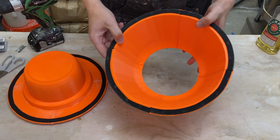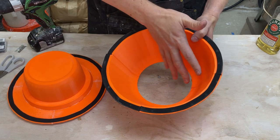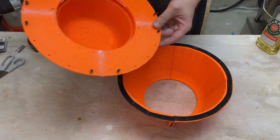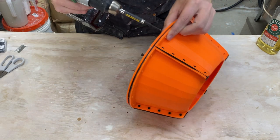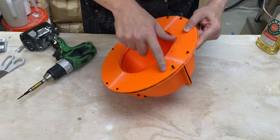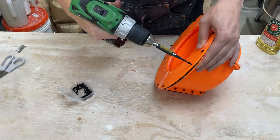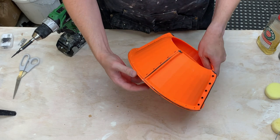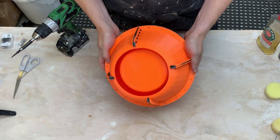So this is the outside of the mold. Maybe a lot of work for the outside, but I found that it really makes the molds a lot nicer. These techniques definitely transfer into other things we want to do in the future. So now we take the inner mold and see if I can get this aligned and the first few fasteners started. Got all those in except for this one - I'm not getting it aligned for some reason, but hopefully when I get the rest it'll be easier. The fasteners are all tightened. Hopefully we have a good seal all along here - the foam is nice and compressed. Likewise on the edges. The inside of our mold should be ready to go.